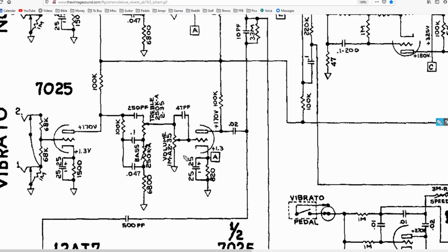Well, it might be because it has a bright cap that's hard soldered into the amp. So you might want to consider clipping it out if you want to use those pedals, and maybe just adding some treble back in here, and it's going to be a little bit more balanced or workable. But on the other hand, that bright cap has a certain type of sound, and there's really no way to get that same balance of EQ. It's not just that you can turn the treble control up and get the same tone and feel. It really is a unique and different sound. So it's definitely something I like to have on a switch. If you want my honest personal opinion, I prefer my amps not to have a bright cap, and I like to manipulate my EQ in other ways. But they are certainly a mainstay of all amplifiers, and something you see all over the place.